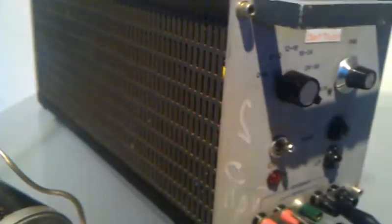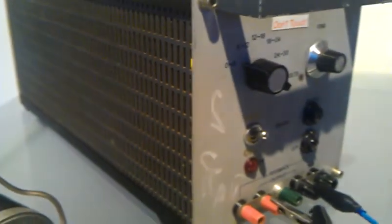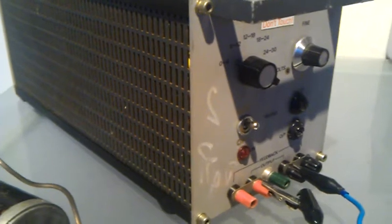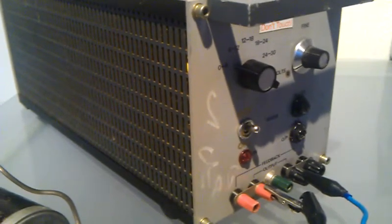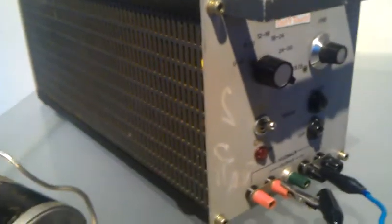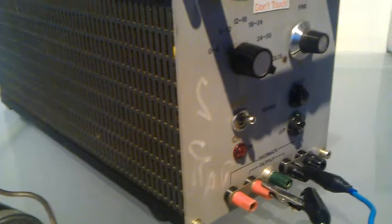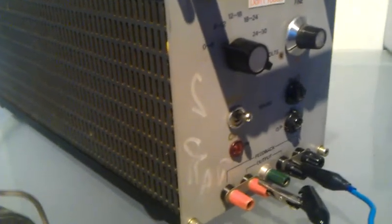What I've done is changed a few of the capacitors, which basically deteriorate after so many years of use. The capacitors in this unit had been in it since it was first commissioned, so I've basically swapped over a few capacitors and cleaned it up completely inside because it was covered in dust and crap.